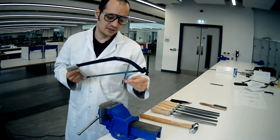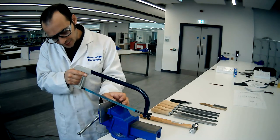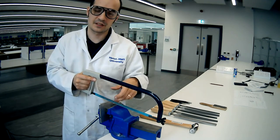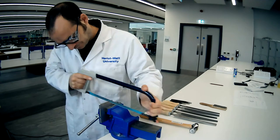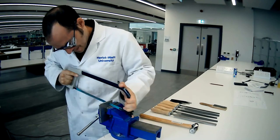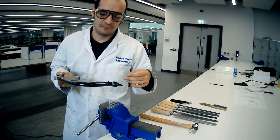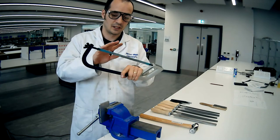Thumb alongside the blade, line it up, a couple of scratches to start and then ready to go. You can see this is higher up out of the vise so there will be more vibration. It's worth noting that piece of metal that's just flown off is going to be extremely hot - metal to metal makes heat. So that's sawing: forward teeth, make sure none are missing, effort in the forward stroke.